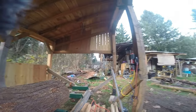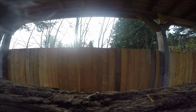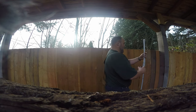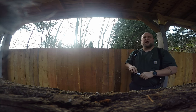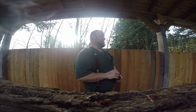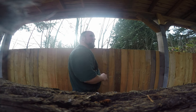This side is up against the fence with my neighbors, so back here I put a little five-foot wall — primarily just to stop sharing my sawdust with them. All in all I'm really happy with it. The other thing is I've got a pretty aggressive drop: we're looking at thirteen feet on the front posts and eight and a half feet on the back, so it's a pretty steep roof. But I want it to shed the snow so I never have to scrape this roof.